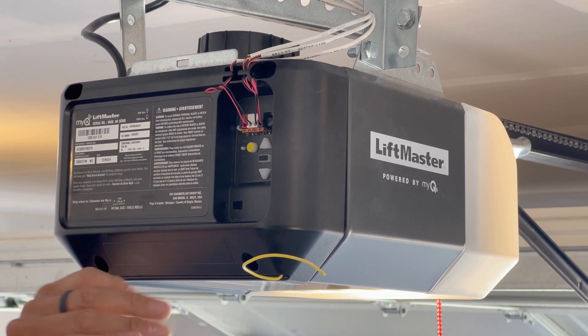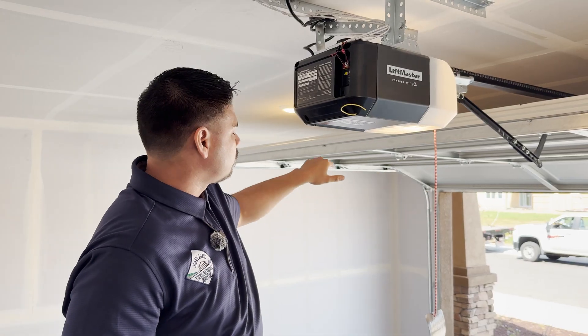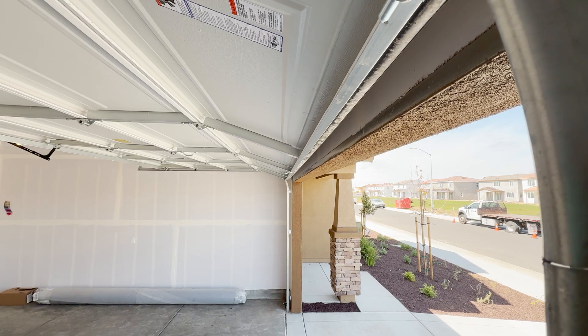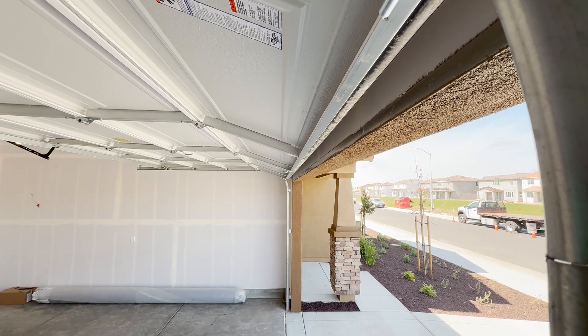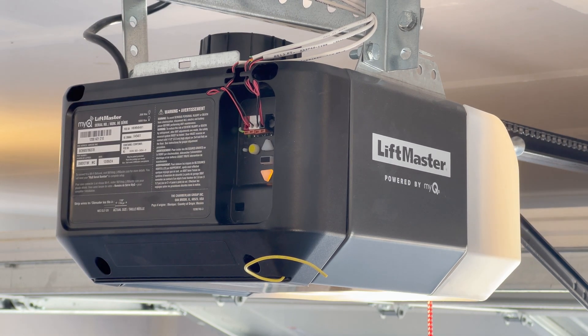You've indicated you're doing your travel limits when the up arrow is flashing. We're going ahead and set the top limit. Once the bottom of the weather stripping is above the top of the header, go ahead and press the black button again. It's been set.